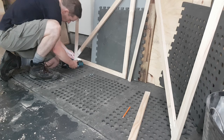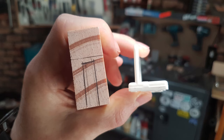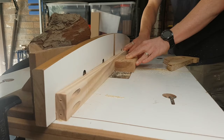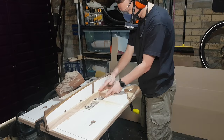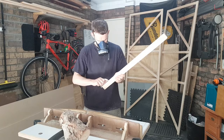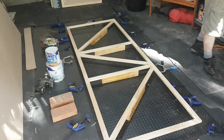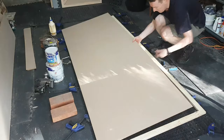I had to remove the lower rail because I needed to cut a relief slide groove for the floor runner — going halfway through those boards. I pulled out the router table and in several passes, just with the 6mm router bit — quarter inch for you Americans — I was able to hog out the middle. These doors basically hang from the top, and that little plastic insert is the only guide keeping them on track at the bottom. I went with 6mm MDF, marking out where all my wood supports are so I know where to put pressure with the clamps. It made things kind of heavy, and maybe you could get away with 3mm, but it seemed to have too much flex — so 6mm it is, even with the extra weight.